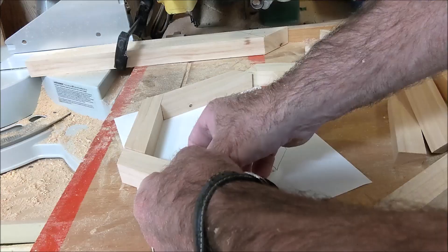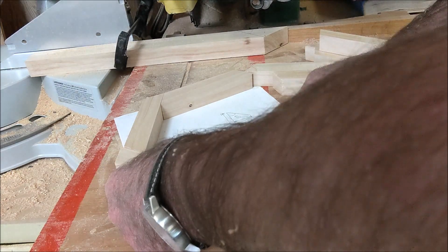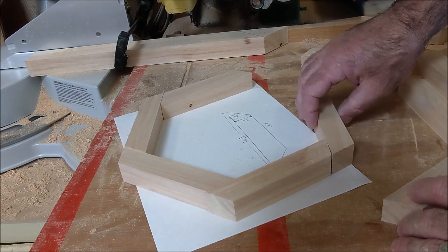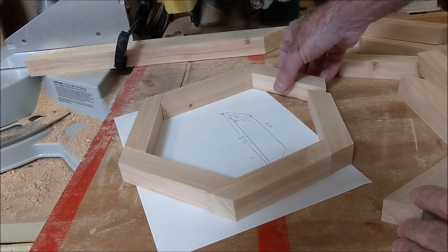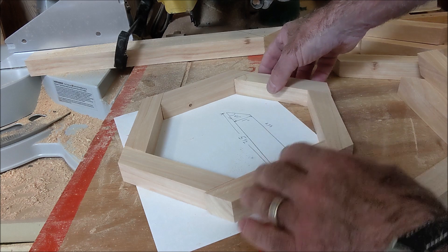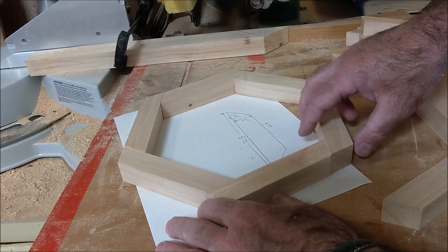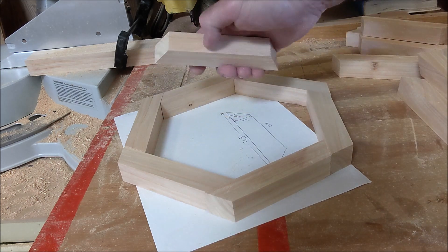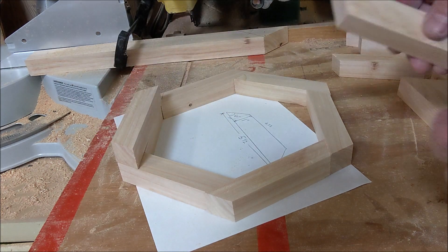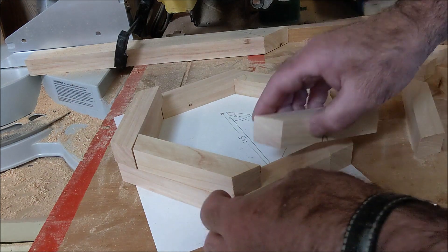So five inches and then two 60s. Putting them together, you can see I have the short side of the trapezoid on the outside of the hexagon, and that way it's going to give me a pretty big butt joint. That butt joint is not going to be very strong on any given one course or level. However, the next course above these will be, because I'm going to have a lap joint over the previous joint, and I'm going to glue on the whole top surface to make it strong. That's really where I'm getting the strength in this project — through those lap joints.